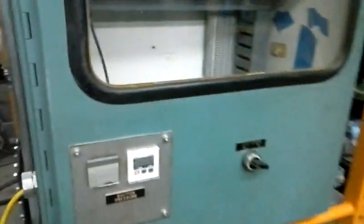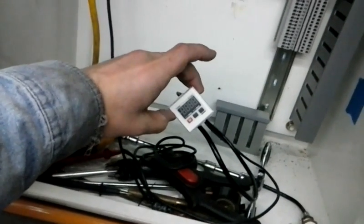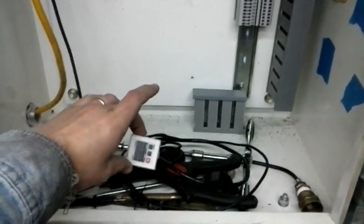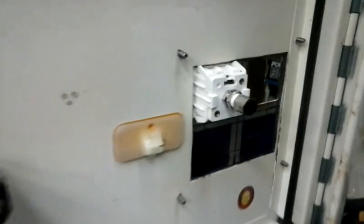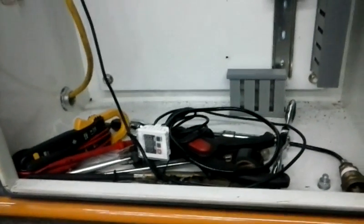I have a cord running inside here — I'm gonna open up this door here for a second. I just have this cord temporarily wired to the PLC and it gives me the opportunity to utilize the 24-volt power supply that's internal in the PLC so I could run these pressure sensors, negative air pressure sensors. They do have two outputs on them but for right now I just have them wired up with power just to see what the pressure is. Whatever vacuum you apply to this hose on these sensors, it reads it on the display so I can kind of see what's going on with everything.